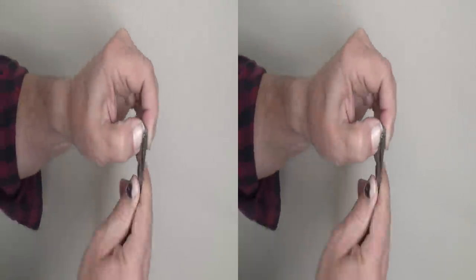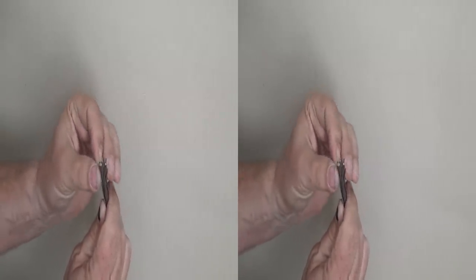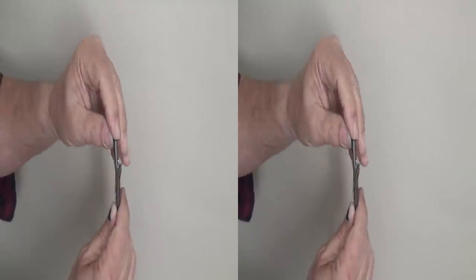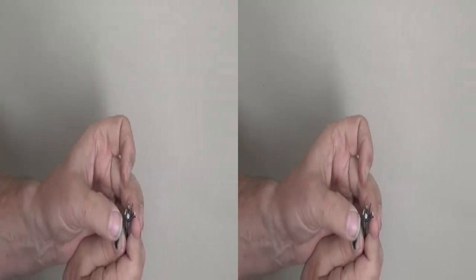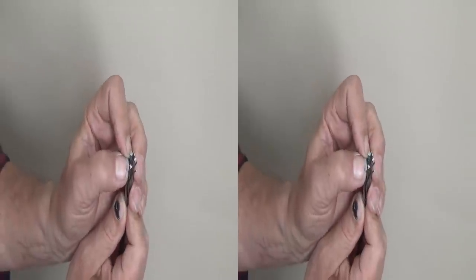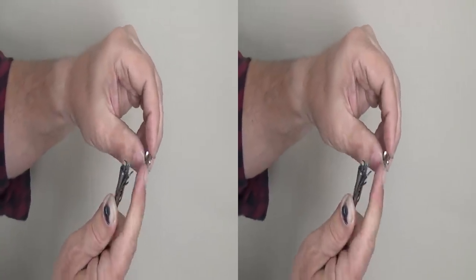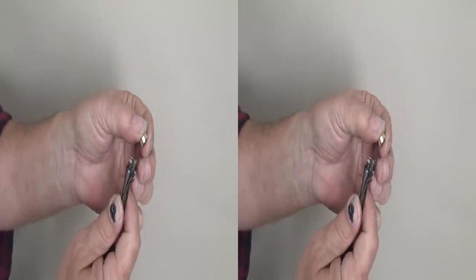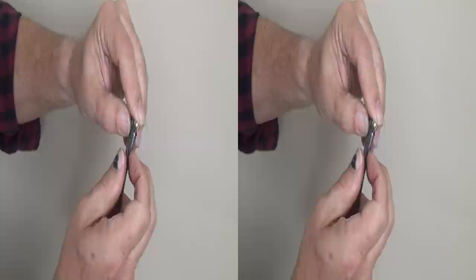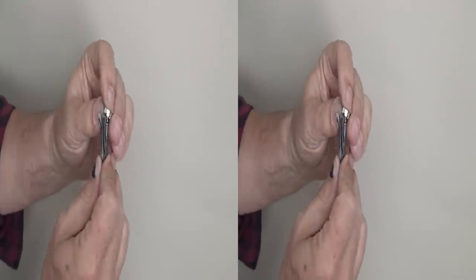This is not an easy job — the wire is tight and does not want to unlay. Once you get those wires peeled back a little bit, you take the cone — it's all reusable, which is really good — and slide it down on the inner part of the wire. You want a little bit of that center wire showing. Then you take the next piece, which has a recess on one side and is flat on the other, and you want that recess to fit down so the cone fits into it — that goes over the wire center. Sometimes you've got to move the little pieces aside, which isn't always easy.